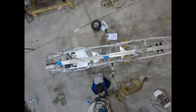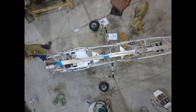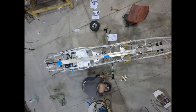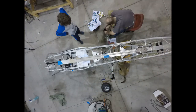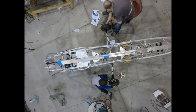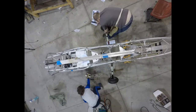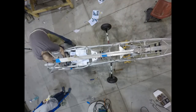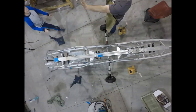With the tire seated onto the rims, I could now continue following the instructions to install them onto the axles and install the hydraulic disc brake setup. Installation is pretty straightforward, but I would actually build up the wheels, tires, brakes, and hub and axle on a bench as opposed to doing it on the airframe as the instructions recommend.